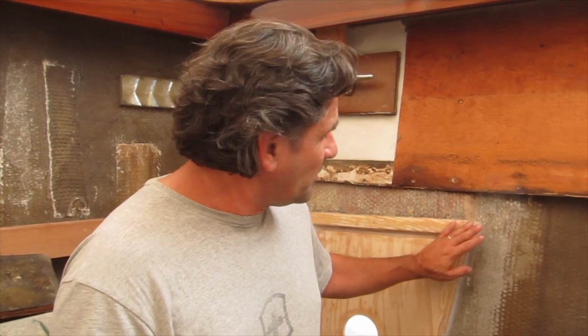So I'm going to wet out all this area with resin first. This plywood here is going to soak up a lot of the resin, and it'll soak the resin right out of the fiberglass, according to all the experts I listen to and read about. After I do that, then I'm going to go through, and it was suggested by this guy on Boatworks today as well, Andy, and I read it in the West System manual as well.